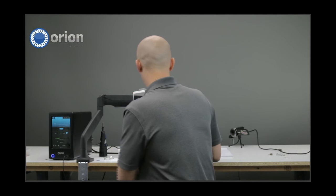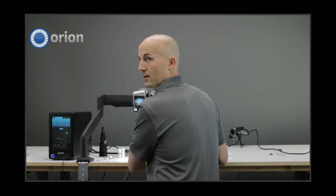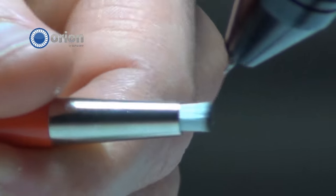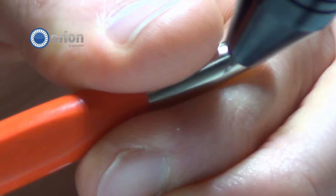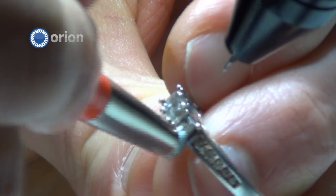When you're done, you have the wire brush. With these fiberglass brushes, you don't want to have them too far extended because the fibers will just break off. Leave about a millimeter sticking out, as you can see in the picture here. Then you can clean up the area where you welded — it just gets the black off the metal.